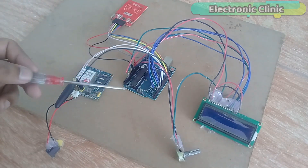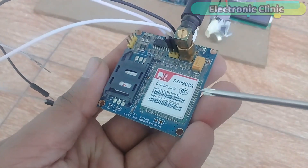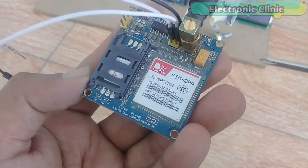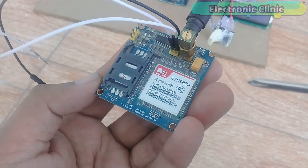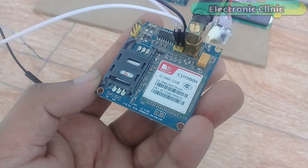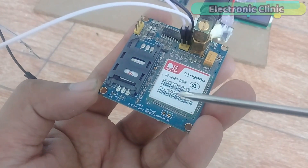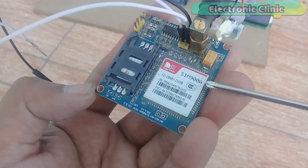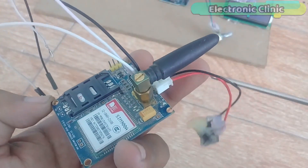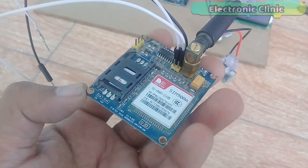The components and tools used in this project can be purchased from Amazon — purchase links are given in the description. This is the GSM SIM900A module. In the market we have different types of GSM modules; the one I'll be using today is the SIM900A. You can also use the SIM900D — I have tested the same programming with SIM900D but with a different power configuration; the rest of the programming remains the same. If you're from Pakistan, Bangladesh, or India, make sure you purchase the unlocked version of the SIM900A. This module has no onboard voltage regulator, so be very careful while applying voltage. The ideal voltage is 4.7 volts, but you can also connect it with a 5-volt adapter.